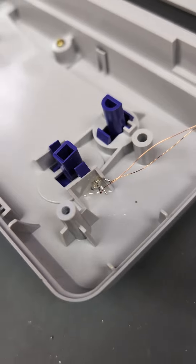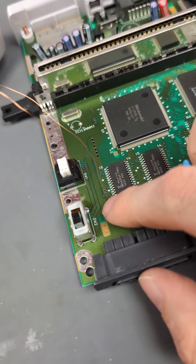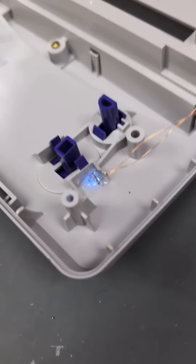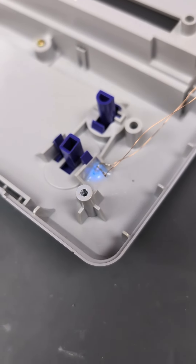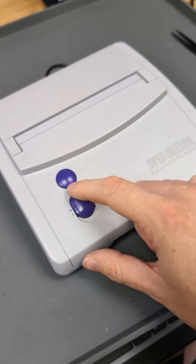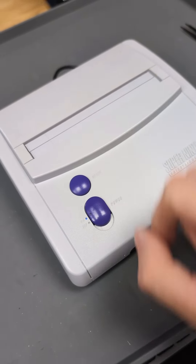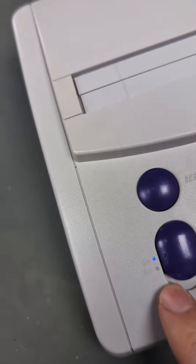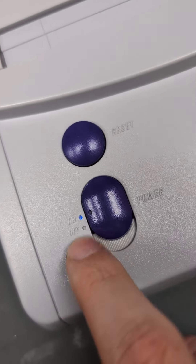So there's the LED epoxied in, wired to the 5V through a 150-ohm resistor. And if we turn on, we can see it's working. You get a nice, really subtle power light — it looks really nice in person. It might come across a bit blue on camera, but that is definitely an ultraviolet colour.